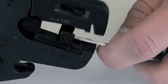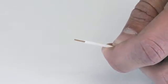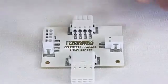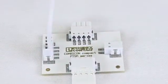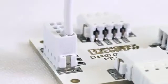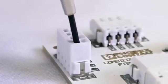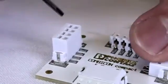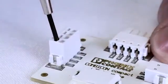Terminating a wire using the PTSM product series is very simple. You'll first need to strip the insulation back 6mm. When using a solid wire, you can simply press it into the wire entry slot and your termination is complete. To disengage the wire, place a small screwdriver into the screwdriver entry shaft. This will open the spring cage so that you can remove the wire. To terminate stranded wire, you will need to use the screwdriver to open the cage when terminating.